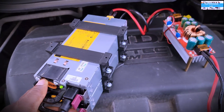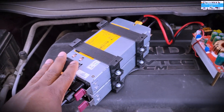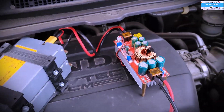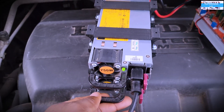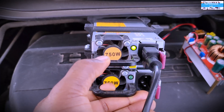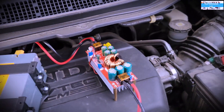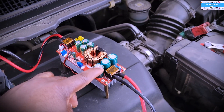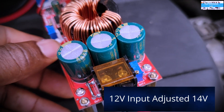As I've shown in my last video, one of my concerns was that if I configured this to be a 24 volt — which is 12 volts and 12 volts in series — I had a concern that I would never be able to use this to charge a 12 volt battery. But then I found accidentally that if I just enable one of the server power supplies, it will give me 12 volts instead of 24 volts. Which is awesome — now I have 12 volts coming in here, and all I had to do was tune it up to 14 volts using the potentiometer there.